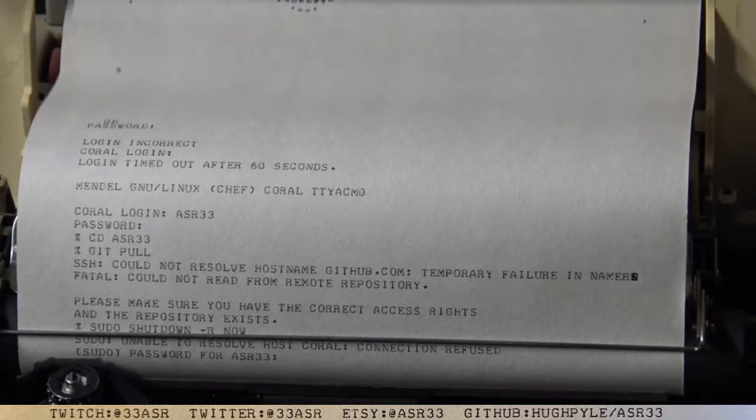Oh yeah, I've unplugged the serial terminal driver, and so now it's chattering because the line is on and break. The line is wide open. If I plug in power to the serial thing, then it's got a loop, and the loop tells it that there's no data. But the current's flowing now, the loop current of driving the serial thing.